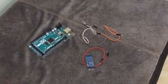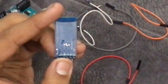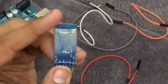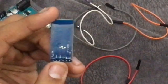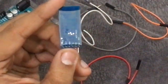First of all, you need an Arduino board — you can use any Arduino board; I am using the Mega here. Then we will need a Bluetooth module. Search online for 'Bluetooth module' — I have linked it in the description where you can buy it. We will also need jumper wires. If you are connecting directly to the board pins, use male-to-female wires. If you are using a breadboard, use male-to-male wires. I am connecting directly, so I am using male-to-female wires.